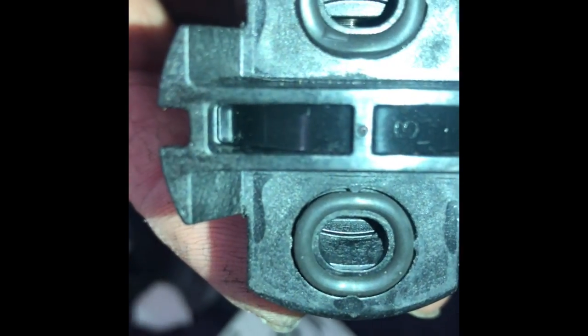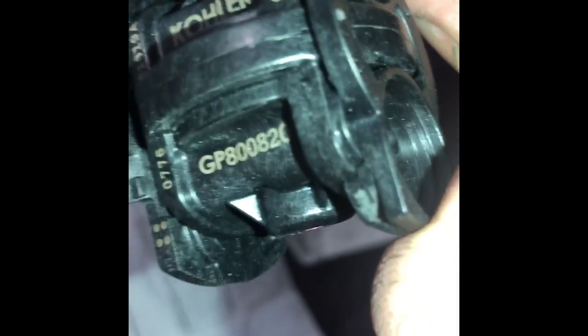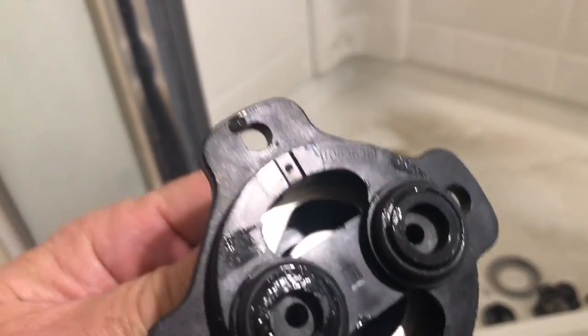You put them on and they end up like an oval. This one didn't come with any grease or silicone. Cold water is on the right, hot water is always on the left, so this cartridge will go back in like this — click. For these o-rings I had some lube, so I put it on the gaskets inside there too. That little piece inside there had the lube in it.